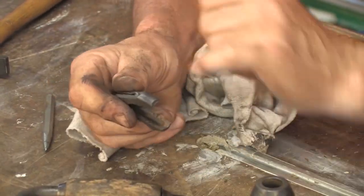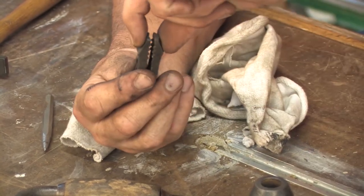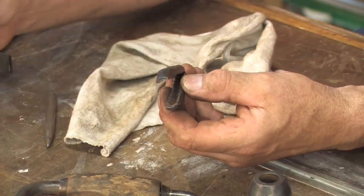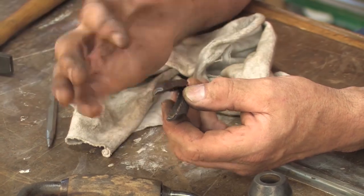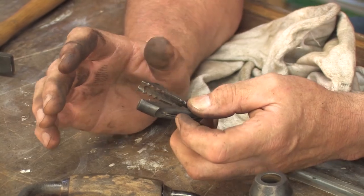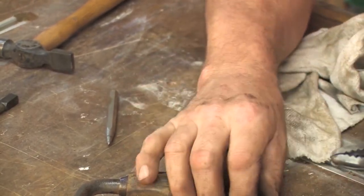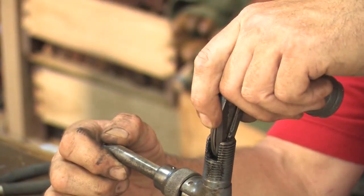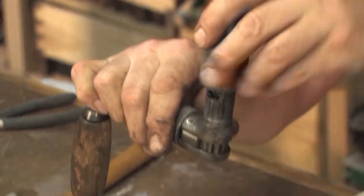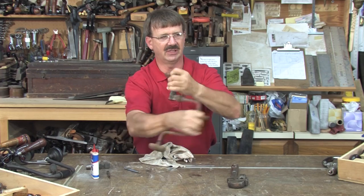Inside the shell, the backside of the jaw rides on it. As the shell pushes it down, it closes the jaws, and as you bring the shell up, they open. So we're going to put a tiny little drop of oil and share it with our finger on both sides. It doesn't take a lot — we don't need to bathe it in oil, it just needs to be in the presence. Now when we set this back in here, we're going to set it in the trough which holds the jaws, pinch the jaws together, and slide the shell down to engage them.